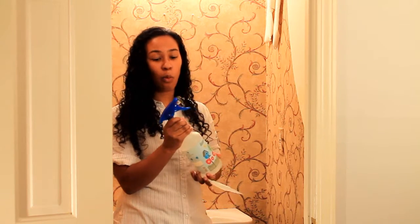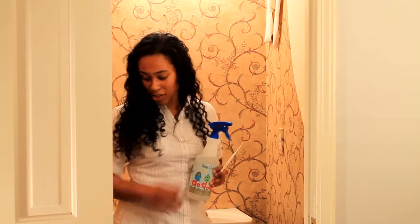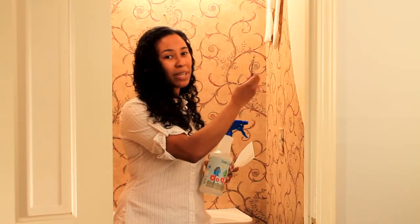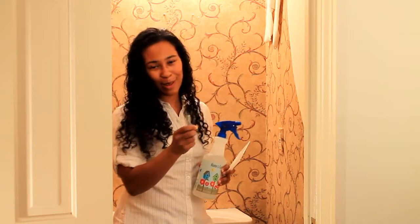Here's what you'll need to get started. You'll need a taping knife — either steel or plastic will do — and some warm water inside a squirt bottle. If you don't have nails, you might also want an exacto knife or something similar to help you get started by picking little pieces of the wallpaper so that you can get your fingers under them.